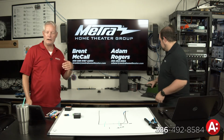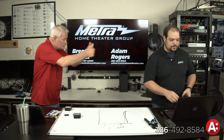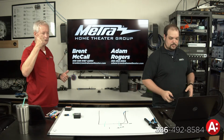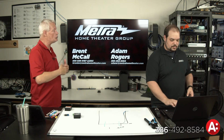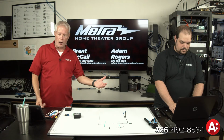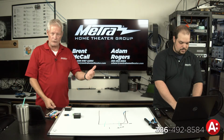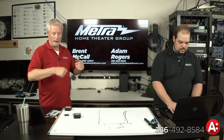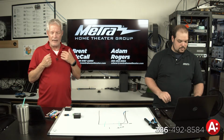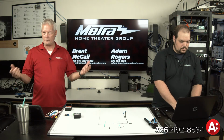And if you're doing a standalone URC, RTI, something like that, or Logitech, yep. What you can do is teach the TV discrete commands on and off to the CS-IR Kit CCUS, so that when you turn the TV off with the discrete off command, it opens the relay. When you turn the TV on with the discrete on command, it closes the relay. And that gives you the ability to do a forced hot plug reset whenever you need it.